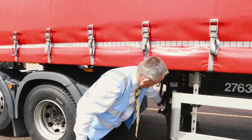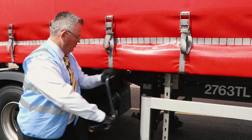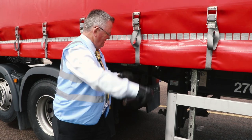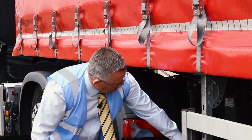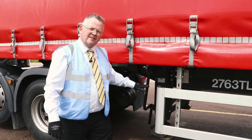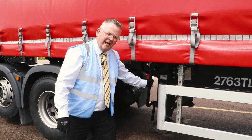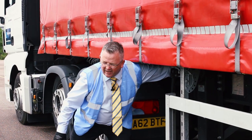To raise the landing legs, exactly the same as before and in the reverse order. When you get to the top, don't put pressure against the legs in order to stow them — leave a little bit. They only have to be 15 centimetres from the ground, and this is well over that. Then you secure the handle and come to the parking brake.